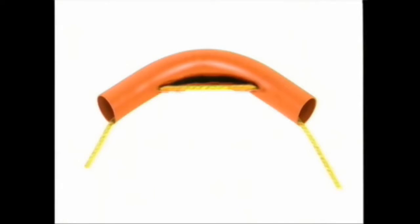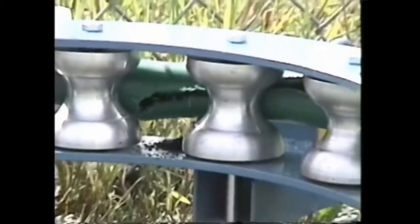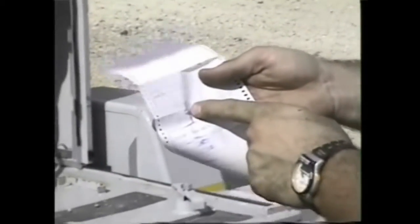Of course, the real danger of using rope becomes evident when the fiber optic cable reaches the jagged 90-degree bend. As the cable is forced through the rough edges of the frayed plastic, its jacket is scored and the fragile optical fibers are subjected to excessive stress. Note how quickly the cable jacket shreds. A Condux electronic control system was used to measure tensions and precisely monitor the force exerted on the cable during both the mule tape and the poly rope pulls. Each foot of the pulls was recorded and documented by the Condux chart recorder.